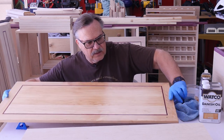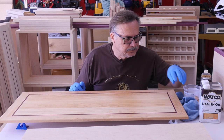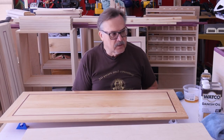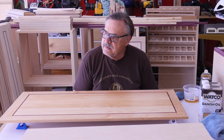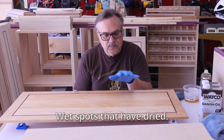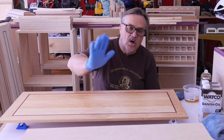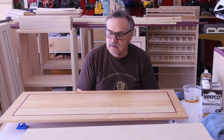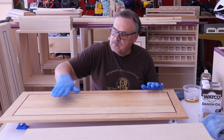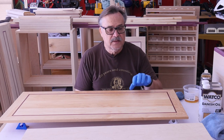Right now this looks pretty good. I like the way this finish looks on this maple and purple heart. I'm going to move this off to the back area and start working on my shelves and other door. If you do have some wet spots, you want to lightly sand them down and then put another coat and wipe it right off — that way it'll blend everything back in. Otherwise you'll have patches where it's shiny and then not shiny and it just looks crappy. If you put too much on, got called away, and came back to just all kinds of blotchiness, that's going to require a little bit more sanding. But the beauty is that you can sand it down and then apply it and blend it right into the next part — and it's just going to look like you did it all at the same time.